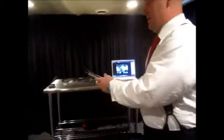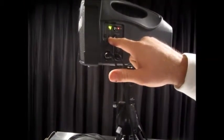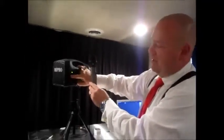The second thing we're going to do is take a look at one of these microphones and how they synchronize to the MA-101. What's really nice about the Mipro system is the ACT functionality — it automatically synchronizes the handheld microphone or the body pack. We're going to take a look on the side of the MA-101. There are two buttons: the first says ACT and the second says scan. The ACT button is the one we care about — it synchronizes the microphone. Right here on the side of the microphone there's a small red patch, and we need to point that red dot toward the MA-101 and press the ACT button.